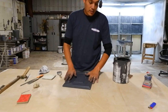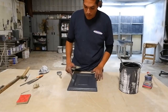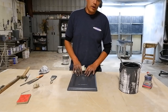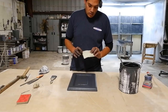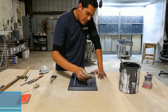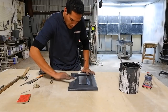Now we're going to get to the powder glazing part of this panel. Powder glaze, if you're not familiar with it, is a very neat product to work with — not only is it a little bit faster, it also gives a really neat look when it comes to some of these distressed or glazed finishes. When we're using powder glaze, I want to go ahead and lightly scuff sand the surface area, just to have that powder glaze have something to bind to. We're going to go to our SurfFlex abrasive — this is a 220 grit — and I'm just going to light sand the panel to get it ready for the powder glaze.